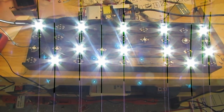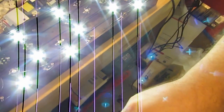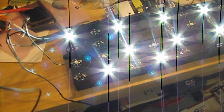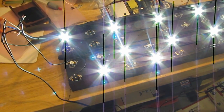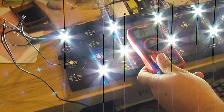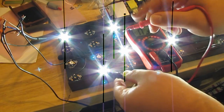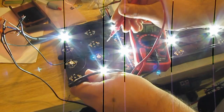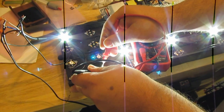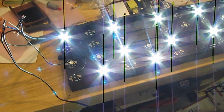The LEDs are really, really bright even at the lowest setting. After that, you want to test the power running through the LEDs using a multimeter — something you really need to have. Pick any LED, put the red cable on the 10-amp terminal and the black common cable on the COM. Test it as if it were another LED in the string by placing the black terminal on the negative side of a powered LED and the red on the positive side.